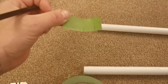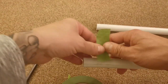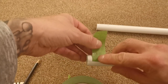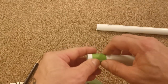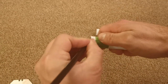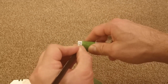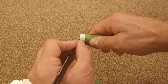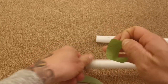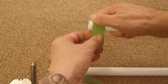I can then find that line again, offer the edge of the tape back up to the line, wrap it around, and then mark at 34mm, 51mm, and 17mm. I can peel that off - these pipes are all pretty much the same size - and do the same for all four ends of the pipe to get pretty accurate markings all the way around.